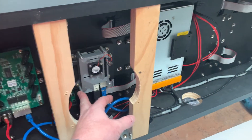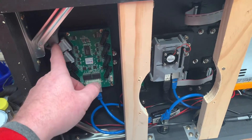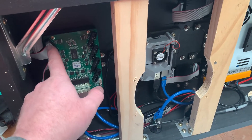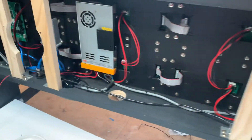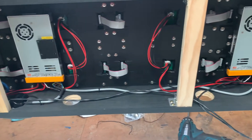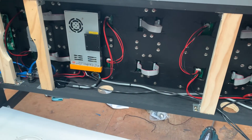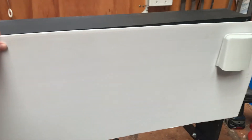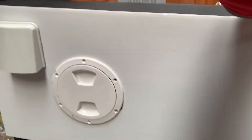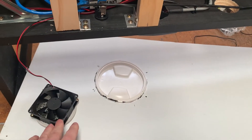Essentially how it's working: we've got a Raspberry Pi loaded with FPP connected to a colour light card. The colour light card has multiple outputs — we're utilizing two, so output one is sending data, daisy-chaining to the top panels, and output two to the bottom panels. We've got a couple of power supplies, each one driving four panels. One thing to note with outdoor P5 panels is they do have a higher current draw than indoor P5 panels. To seal the back up we've used a piece of corflute — you can see what's going on — and there are a couple of air vents in there. We're extracting heat out with a couple of fans.